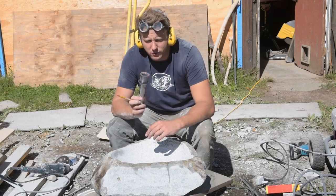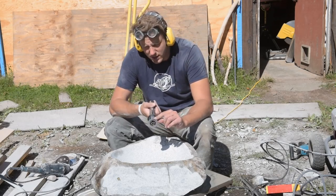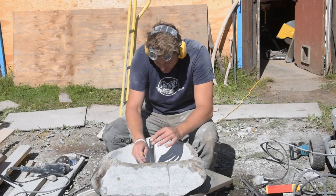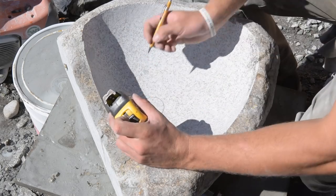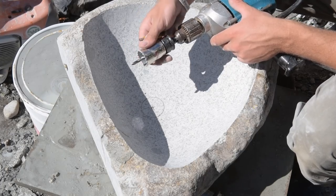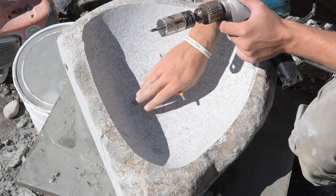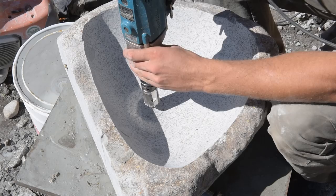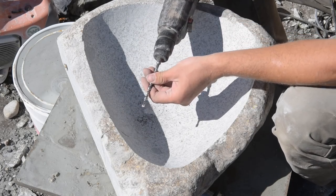It's just a stock chrome-plated drain that I got from a plumbing wholesaler — I think it was about 40 bucks — and then I got a little bit of plumber's putty that I'm going to set the drain in underneath the flange once I have it all carved out. I'm putting the drain upside down at the lowest point on the sink and just tracing it out. Once I've got it traced out and I have a nice center point, I got this inch-and-a-half diamond hole saw bit from the tool store — about 60 bucks total, 30 for the mandrel and 30 for the diamond bit. It's got a carbide tip that says it can drill through concrete and cast iron — we'll see if it can drill through stone. I'm just putting in a quarter-inch SDS hammer drill bit first, which will go through the stone no problem.